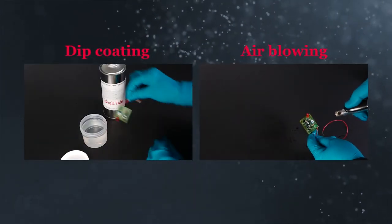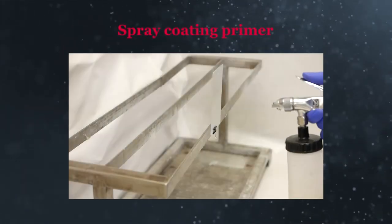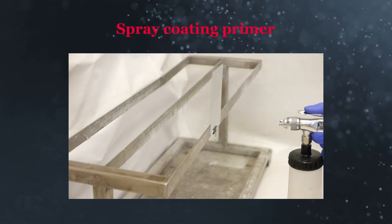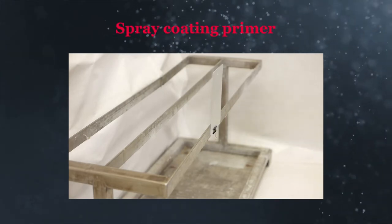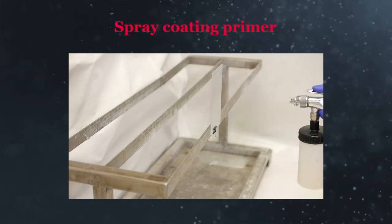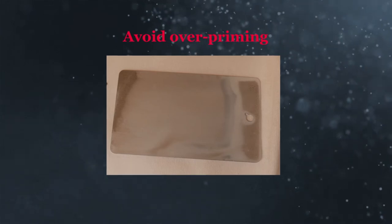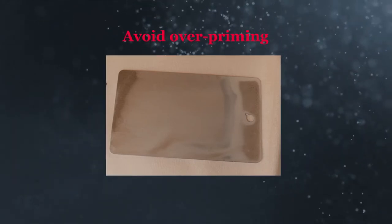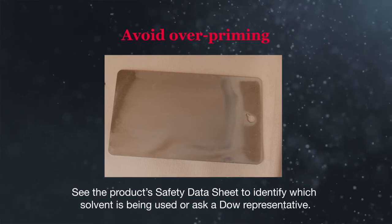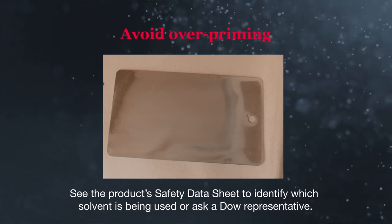For both manual and automated processes, parts can be dipped in primer and excess blown off with pressurized air. The most common way to apply primer is by spraying. Simple airbrush or paint sprayers work well. Using air passed through a drying agent will help to keep the primer in top condition between applications. Just barely wet the surface — less is best when it comes to how much primer to apply. It is easier to apply too much primer when spraying, characterized by a white chalky residue on the primed surface. To help avoid this, some users add solvent to the primer. Use very dry solvent, and the best are those already in the primer. It is common to dilute with two to four times more solvent when spraying.